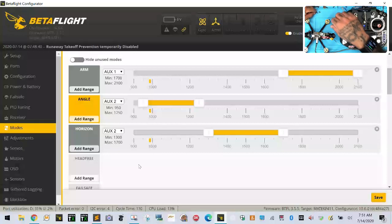They don't look the same length, I can tell you that. And they're not. So one's a little bit bigger than the other one by maybe a millimeter or a little less. Okay, so that's that. So we have a motor that has definitely got problems. Yeah, that's not going to work. This motor's just hung up. And it looks like the bell is bent, and I can see it pressing.